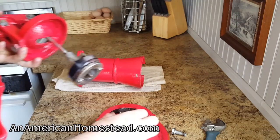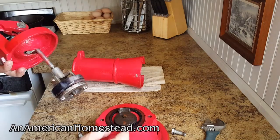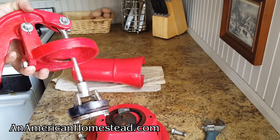It's fully disassembled. You can see this is the flapper valve — it basically just comes off like that. This is a check valve that keeps the water at the right level. Now that I've pulled this off, the water has sunk down into the tube. This is the seal — it's made of cowhide. This cowhide basically expands when it's wet, and if you don't use it for a while and it shrinks, you won't have a seal, so you have to prime it.